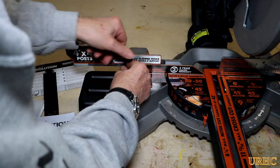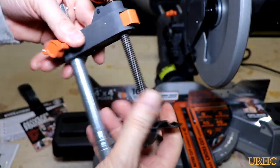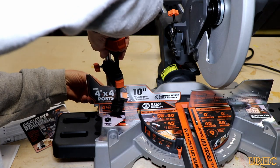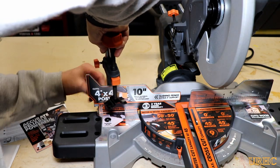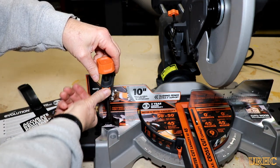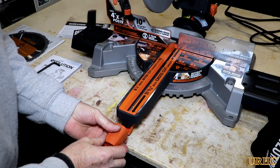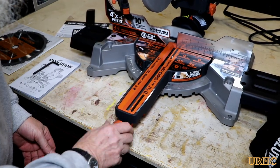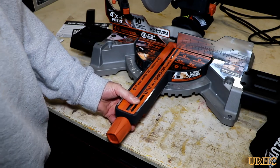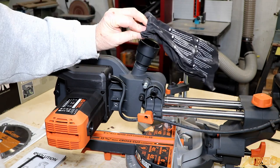There are just two screws on each side, and once cranked down the tables are very sturdy with no rocking - I think they're better than the old bars. This will also let me get rid of my big old worn-out DeWalt to make room in the shop. They've split the fence so you can get a higher fence on the inside edge. The real neat thing is the reworked clamp - it's got a quick-adjust feature plus a shape on the bottom that allows clamping onto angles face-down or onto round tubing.